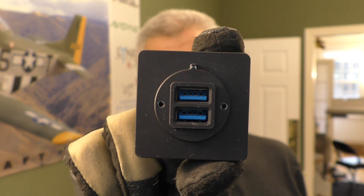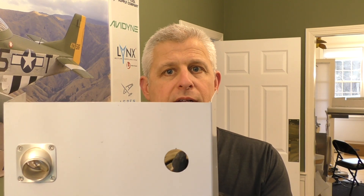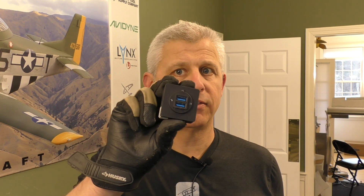Ben marked it out and the hole is now all set. One thing you might notice if you look closely is a little mark at the top — that's actually a little indexing segment, part of the circle that comes out. So we need to take a file and notch the hole, put a little notch at the top port so this doesn't turn and is locked into place. I'm going to file out that little notch and then mark from the cover plate where the two screw holes will go, drill those out, and mount it.